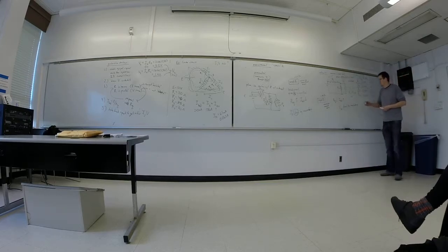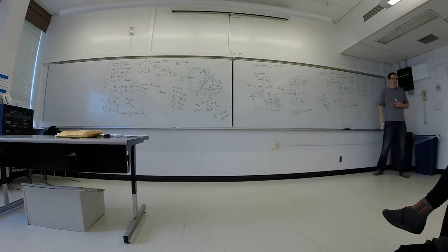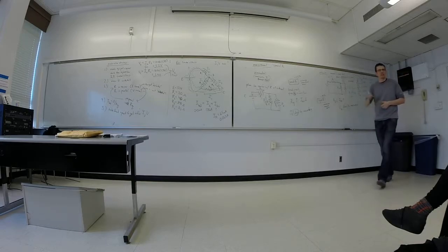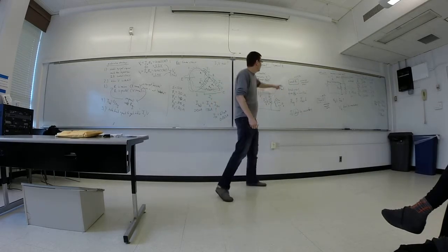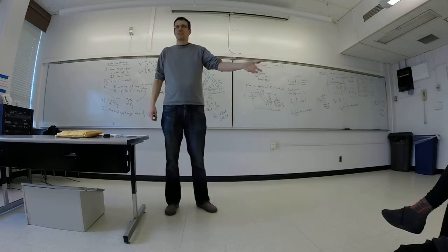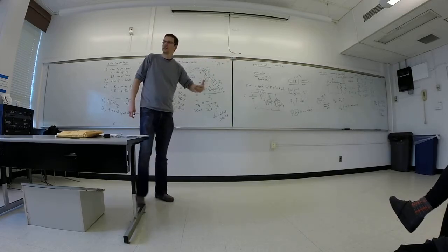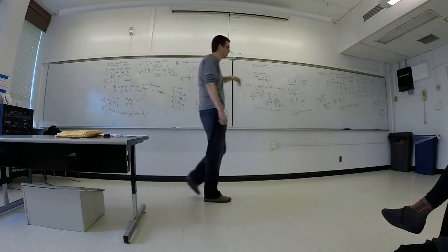But here's the real big issue, okay? If you put an ammeter accidentally in parallel, you've just put in a tiny, tiny resistance as an extra parallel branch. You've put in a half an ohm or something tiny like that, and you've just given a way better option to go through than the resistor that it's in parallel with. So what's going to happen to the total current? It's going to go way through the roof. You can have a massive current surge. Okay?